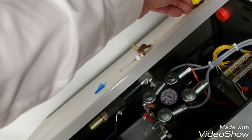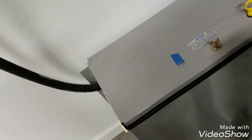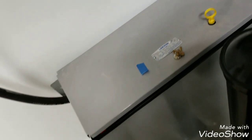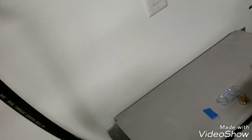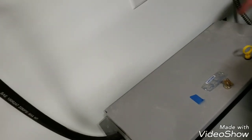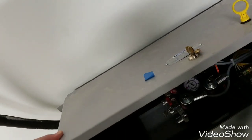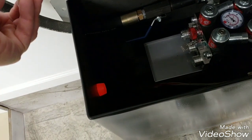How high does the oil go up? It'll never get above those holes — we fill them until about right here. So even if we let all the oil in, all the oil will never come back out because that hydraulic piston takes a lot. You get about 10 gallons and it'll stay in there. What symptoms will we see if that oil level is too low? The main sign will be — if you do ever get a leak, which is the only way any oil will ever get out of here — you'll actually hear this tank kick on and re-level about every hour. You'll hear the motor kick in for a second even if you're not using it. Where's the motor? It's actually in here — it's submerged under the oil.